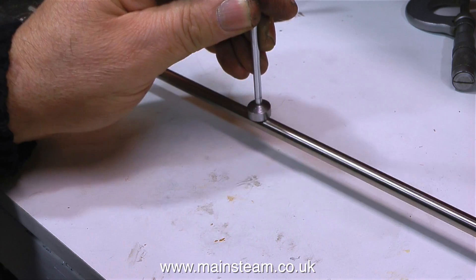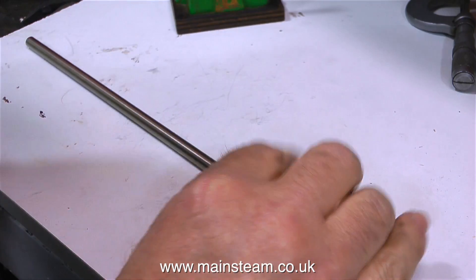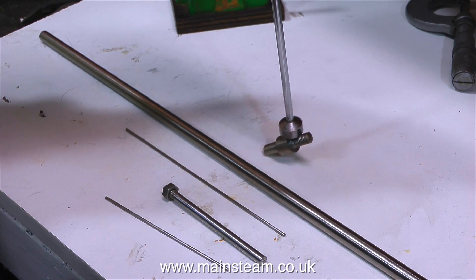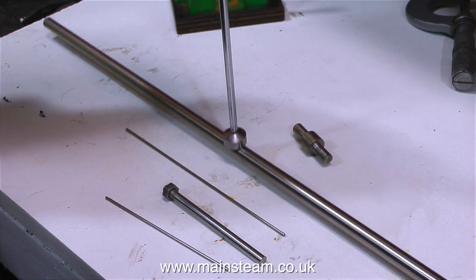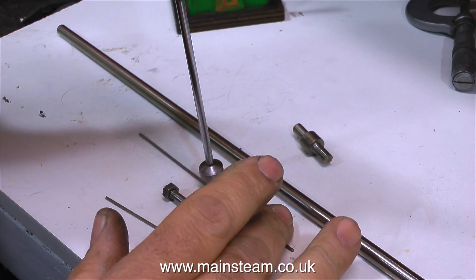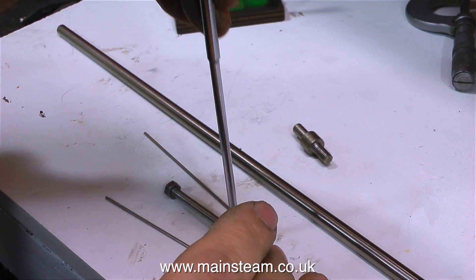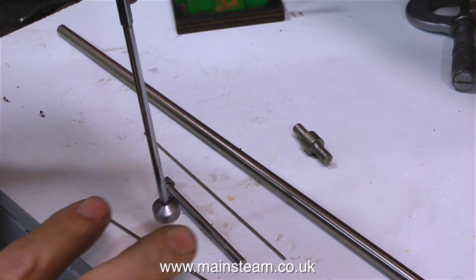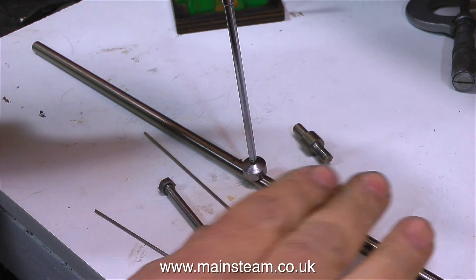Just to diversify for a moment: if you watch what I'm doing, I'm using a magnet to pick up this piece of silver steel. And as you can see, the magnet picks it up as you would expect. These other pieces of steel are not terribly magnetic — sort of magnetic, but not very much. And these small pieces appear to be a bit magnetic, but they're not really. This piece of steel is also not very magnetic. The reason is that the large piece is silver steel, and the other pieces are stainless steel. Stainless steel is generally non-magnetic.